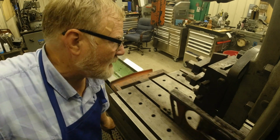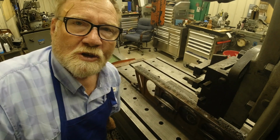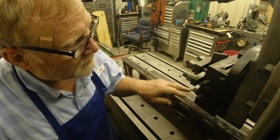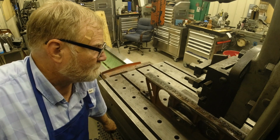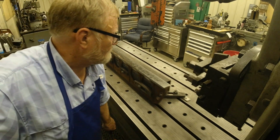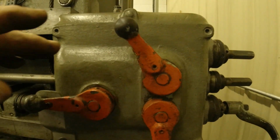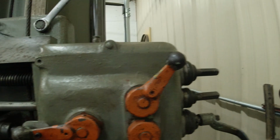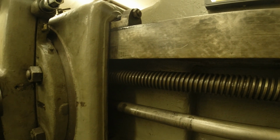And I hit spots like that. I'm going to come back over in the reverse direction, like a spring pass. That hard spot lifts this huge clapper box up in the air a little bit. It's easy to change directions on this. All I have to do is move this gear to the other position. Now that gear there, the shaft turns it and starts bringing it back.